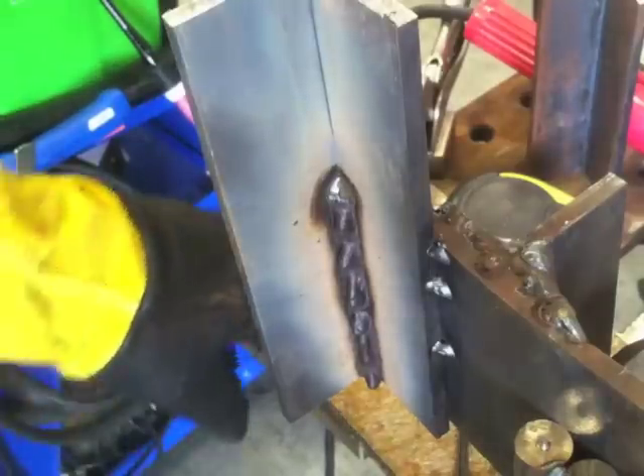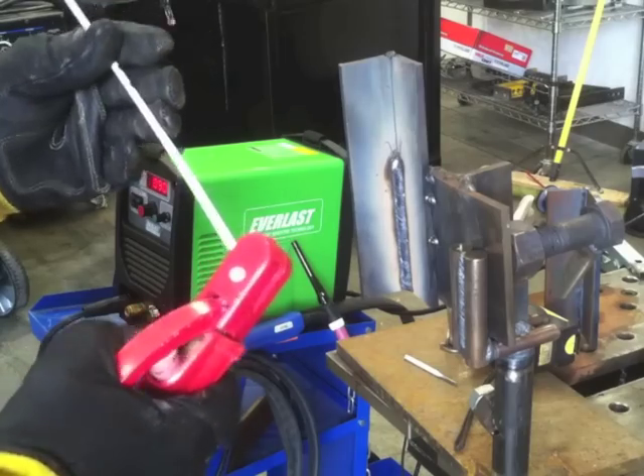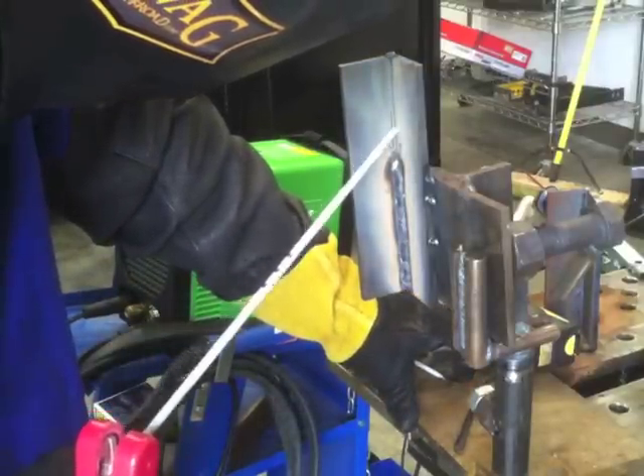The slag popped off really easily welding down flat in the other video. It's not coming off quite as easily here, but it's no trouble at all — it was curling up big time on the outside corner laying flat, just curling up behind me. Now, you want to keep your arc strikes where you're going to weld over them, so I'm going to light up right ahead of where I'm going to weld, come down into that crater, and keep welding. Keep a good tight arc. When I say tight arc, I mean I can pretty much feel that flux on the rod scrubbing against the metal. I'm speeding it up here a little bit so you can see the little loops that I'm making.